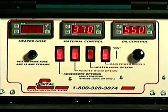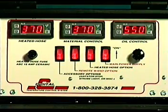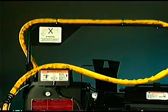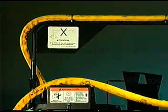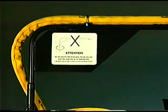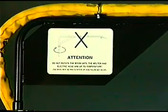Start the hose system. If the electric hose has material inside, the temperature control may now be set to the manufacturer's recommended pouring temp. If the hose is empty, material should be pumped through to fill the hose before activating the hose heating element. Because Simline's electric hose is such an effective heating device, the hose heating process should only be activated with material in the hose. Standard non-heated hoses should remain coiled within the heating cabinet until the system is up to pouring temperature.